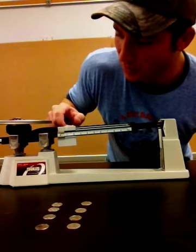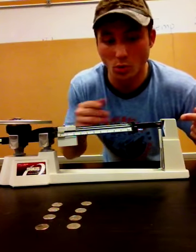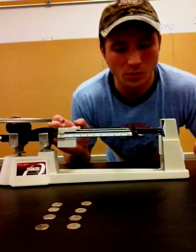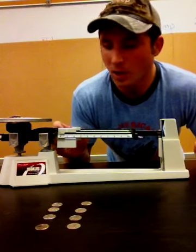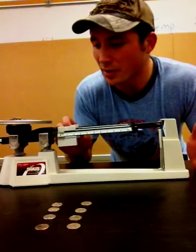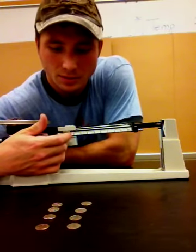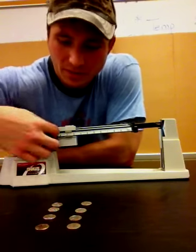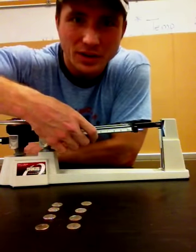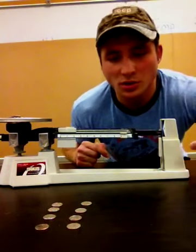When I move this one over I'm gonna move it over to 10. Notice that it did not yet go down, so I need to add more weight to the side of this triple beam balance. So I'm gonna go up to 20 grams — it's starting to drop there. I'm gonna have to go back to the 10 grams and start moving this smaller gram measurement. This is my smallest measurement that I will use on the triple beam balance, and I'm gonna move this over — it's probably gonna go almost to 10. I'll move this over until my balance starts to go balanced.